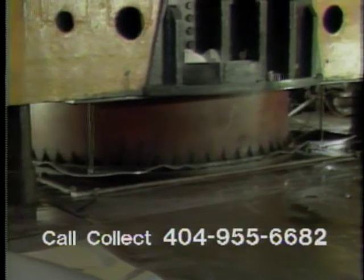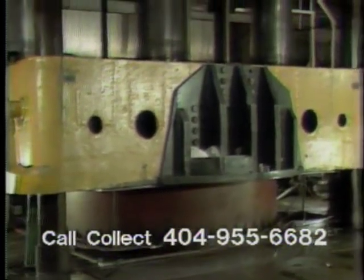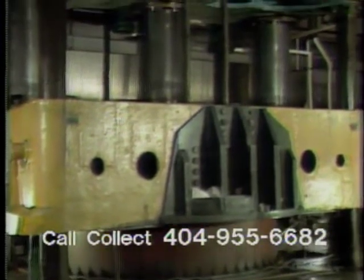Coltronics knows that because the press die is extremely accurate, thousands of dishes can be turned out with the same high quality. This is not the case with spun metal dishes, where each succeeding dish varies from the die because of the wear during the process. Stainless steel was chosen as the metal because of its vastly better tensile strength and qualities of reduced heat expansion. In fact, it has twice the resistance to heat expansion as aluminum and has 3 times the tensile strength. It's much smoother and is also non-corrosive.